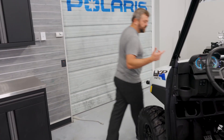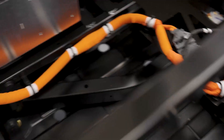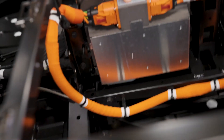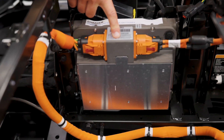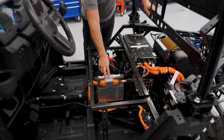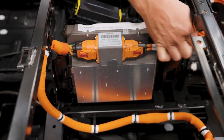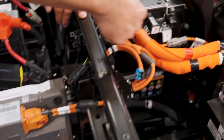Now I'm going to walk around to show you how the power flows through this vehicle. You can see where we plugged it in on the side, and then you follow a big orange cable that comes down and goes right into this box right here. This is the charger on this machine. What this does is take that AC input from the wall and convert it to 100-volt DC power, which comes out these two cables and goes into this high-voltage battery pack.